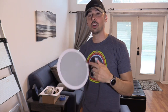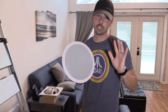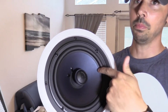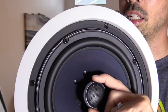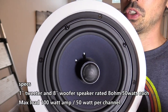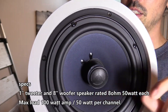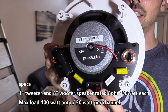What's up guys, this is Tampa Tech and I'm going to show you how to install these Polk Audio flush mount ceiling speakers. I'll show you some tricks installers use to make installation a whole lot easier. They have two speakers in one — your high and your mid — and they have decent bass so you may not need a subwoofer. You can adjust the high for great clarity during dialogue and aim it toward the couch. On the back is where you connect the positive and negative speaker wire.